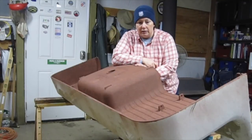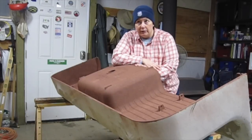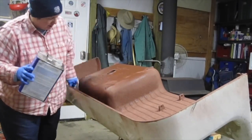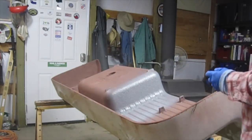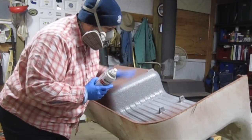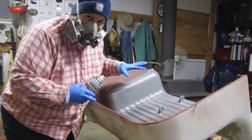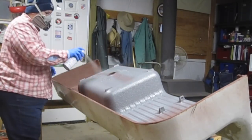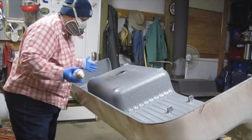It's been two days since I prepped and painted with primer the bottom of the sink, and it has a nice matte appearance which means that the primer is set up. I'm going to wipe it down again with denatured alcohol before I move on to applying the top coat, which is going to be a gloss gray enamel. For this first coat I'm trying to do a really thin coat to make sure that it's really going to adhere. We're at about 45 degrees and so that's pretty marginal for doing paint. The first coat of the gray is on and it looks pretty good — looks like it's adhering, so I'm going to go ahead and do another coat.